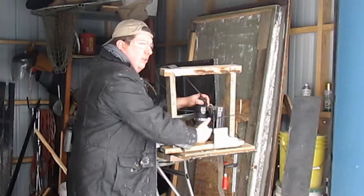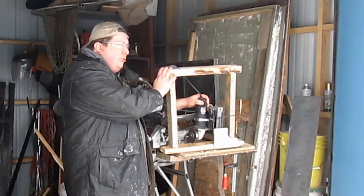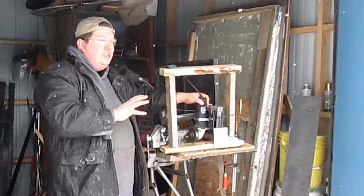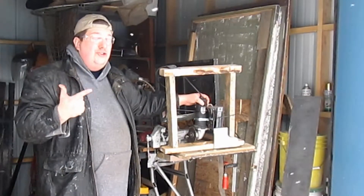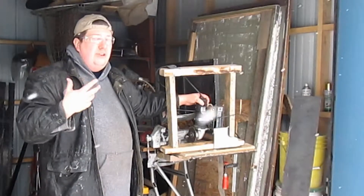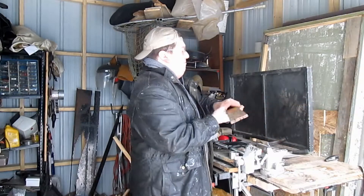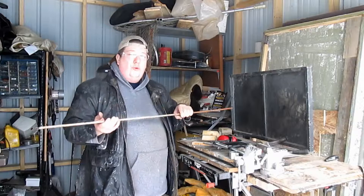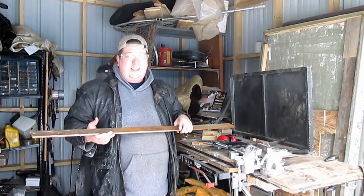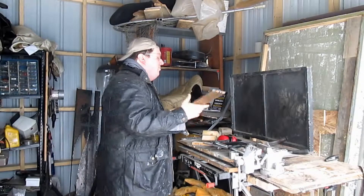All of the wood here — nice white oak — is to absorb vibration. If this thing vibrates, you won't get a clean cut and your angle grinder blades could shatter in your face. Now what I'm going to be chopping through today is this almost ten-pound piece of quarter-inch copper-coated stainless steel. It's not nearly the toughest thing I chop up, but it's a good demonstrator.